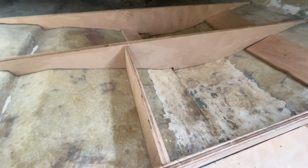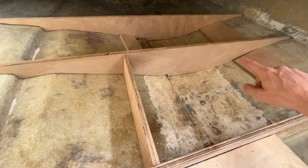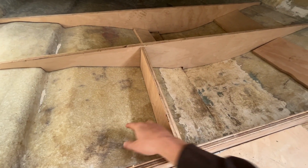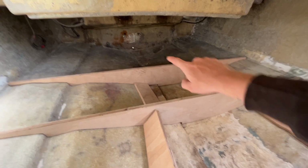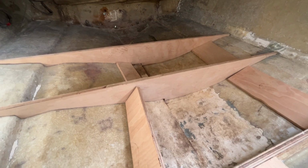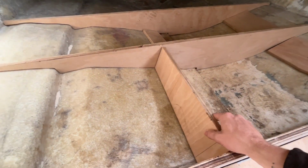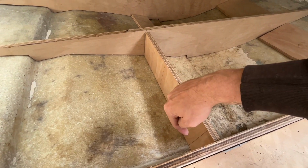So the first thing I've got to do is cut all the drain holes for the build. So, you know, the corner ones that are done underneath these ones, just so if any leaks happen here, it drains away into the middle and goes down to the bilge, which will be sat down there. So I need to cut a half circle there, same as that, and those 4 as well in the corner, which is the lowest end of the boat where it sits. So if you see like that one, the lowest point will probably be right here.